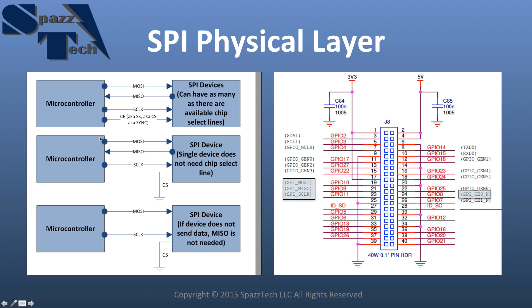The next example of how this might be connected is a case where we're only ever going to have one device on our SPI bus. If that's the case, we don't really have to have the chip select line connected to the master — it can be hardwired to either low or high depending on the device. The device we're using today wants to see a low signal there to signify it's selected, so we'd tie it to ground. Another device might want a logic high, in which case we'd only need three lines connected.